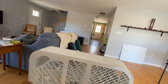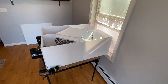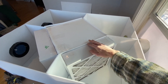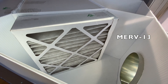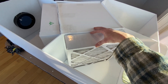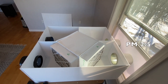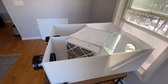It's not elegant, but it keeps my air healthy to breathe, and that's my top priority. In the future I'll think about making it more elegant. The part I'm most proud of are these filters. It has two MERV 13 14-by-14-inch filters that are 4 inches thick. Lower MERV ratings than 13 do not cut it. MERV 13 filters prevent harmful small particles — PM 2.5 — from being sucked into my house, and they also keep the core clean and functioning properly.